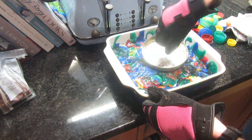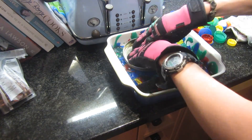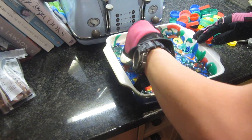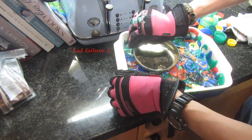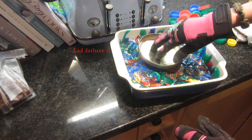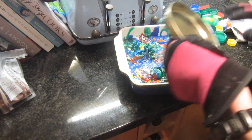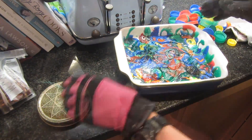Now I come back to it and all of them are molten very nicely. As you can see, since it's quite hot and runny, some of the air bubbles are rising to the top — if you're getting that, it means you're getting a good temperature. If it's only just starting to become runny you might want to turn your oven up a little bit, but be careful not to turn it up so hot that the HDPE starts to scorch.